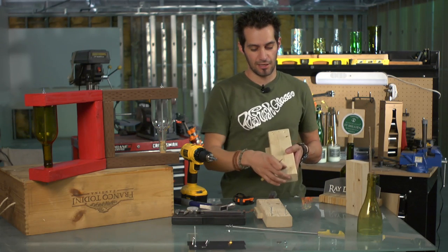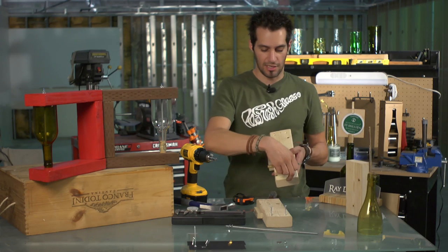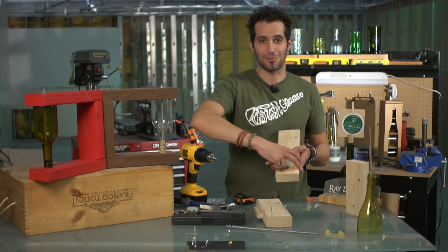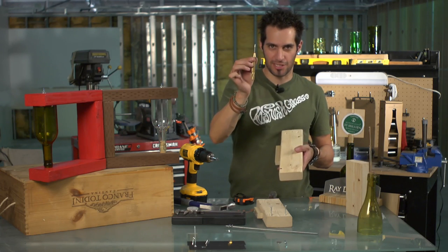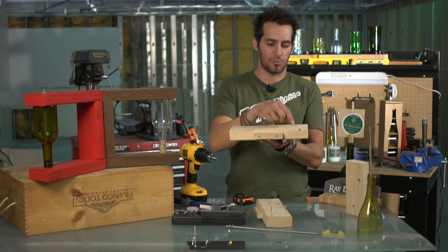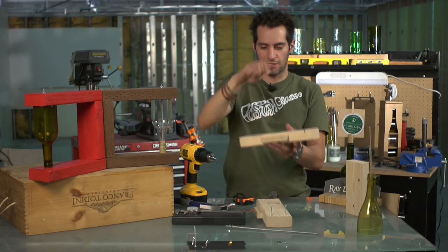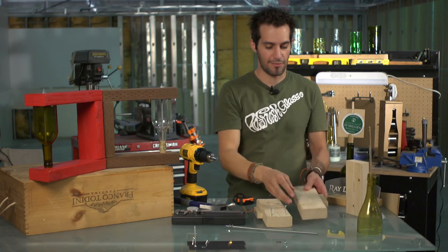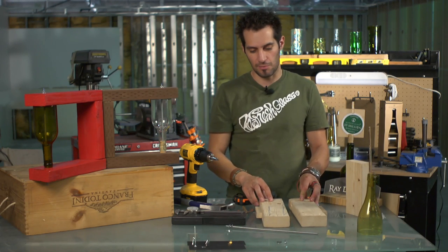Then we're going to go to the other side: measure one and three quarter inches and three quarter inches from this distance, and measure how wide your two-by-four is because they're usually not actually two by four. Find the center and use your center punch again — make an indentation and drill your hole. I really recommend using the drill press because the more perpendicular it is, straight up and down, the easier it is to line up the all-thread once you get the two sides. So now we have our holes drilled — two on one end, one on the other, for both sides with the same measurements.